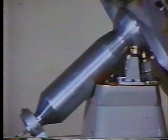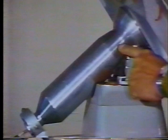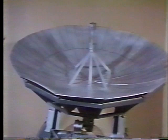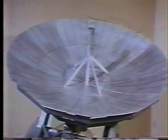A polar axis steel shaft, parallel with the earth's axis, is supported on its spherical north end by four hydrostatic oil pad bearings. A steel yoke bolted to the sphere holds the gear to rotate the telescope east and west, the counterweight to balance it, and the drives to rotate it north and south. The antenna is made up of an aluminum truss superstructure supporting the aluminum solid surface and a four-legged focal feed support.